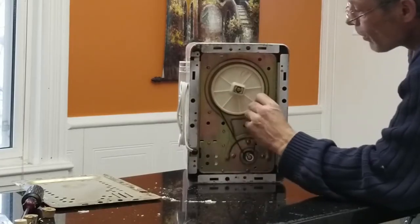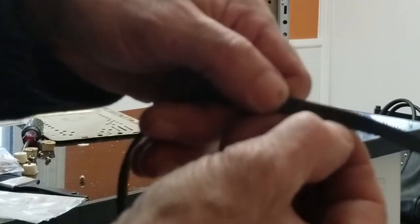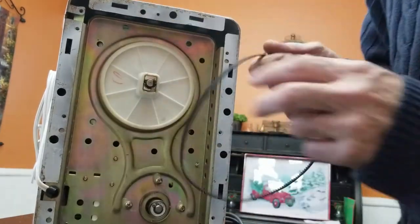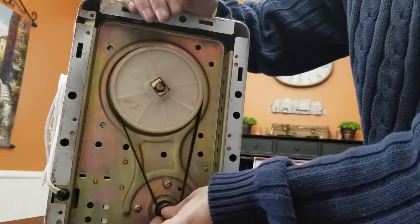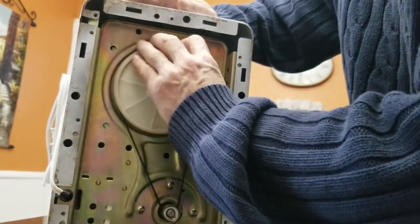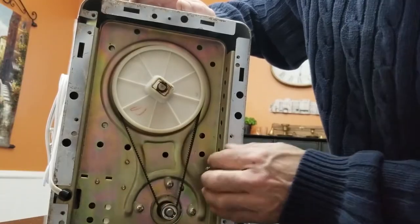Let's figure out why it's slipping. We're going to try and take that belt off. When you have a really good look at it, the cogs all still seem to be in pretty good shape. There's a number here and we're going to write that number down because if we have to get a new belt, that's the number we need. But this belt, when it's on here — I think what's happened is that the belt is just stretched out too much, because that seems like a considerable amount of play.